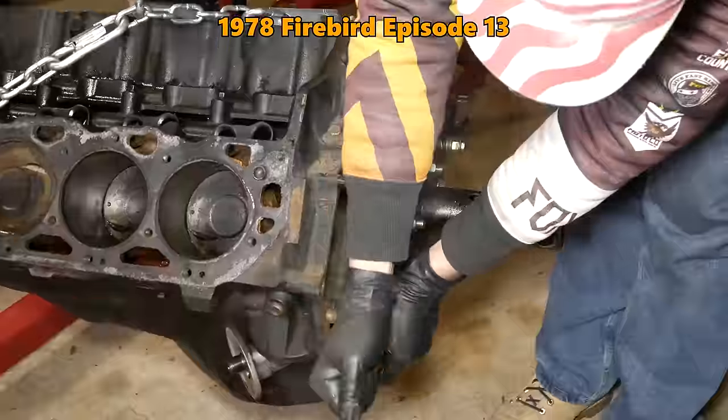It's hardly an insurmountable obstacle, but I do think it could be a bit easier. All we're gonna do is install bolts to the standoff arms, tighten them down just enough to hold them in place, and weld down the heads. We'll do this in a few steps, being careful to not overheat the bolts. Once they've all been welded in place, we'll cut the last few threads off so that the bolts fit the stand perfectly, and then give each of those arms a fresh coat of paint.